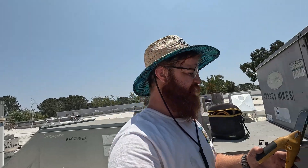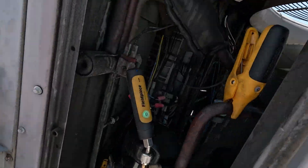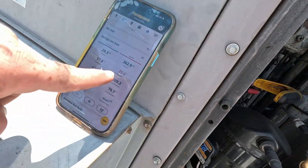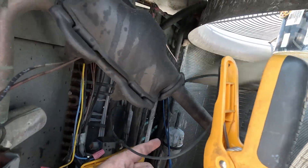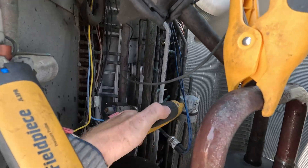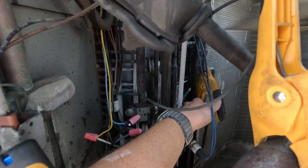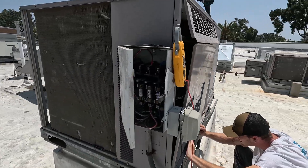Take a video of this — this is very easy. We look in: we had this line sweating, and our pressure reading was very low. You never want to trust it, but this temperature right here is like 30-something degrees. Looking at the filter dryer, it doesn't look like it's sweating on the inlet side. We took the temperature before the filter dryer and we're at 106 degrees — restricted filter dryer.